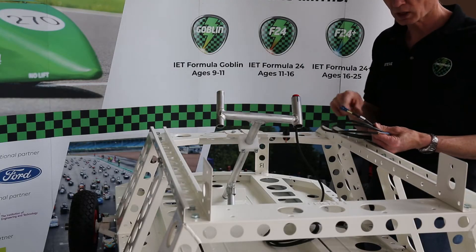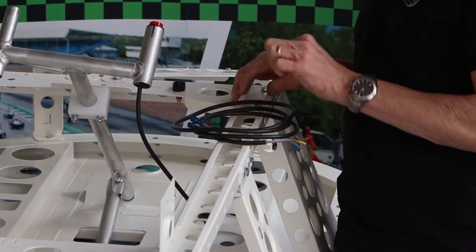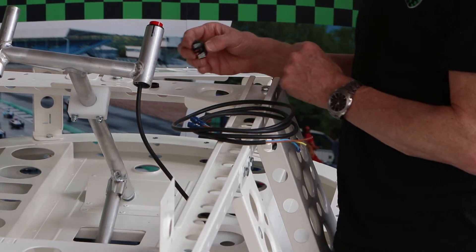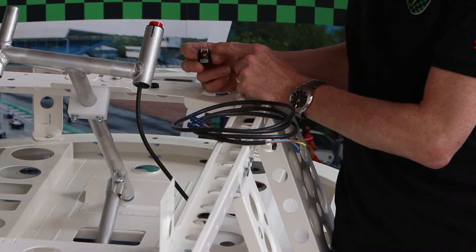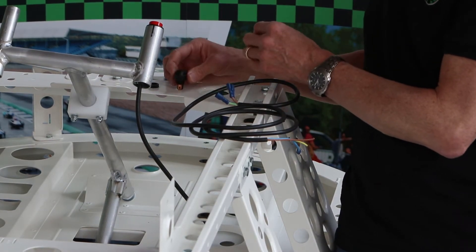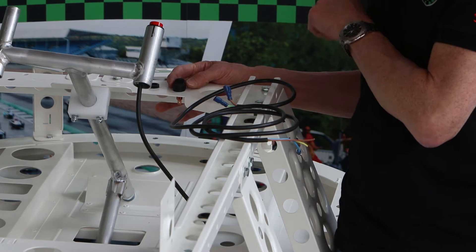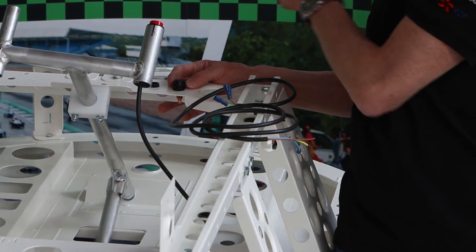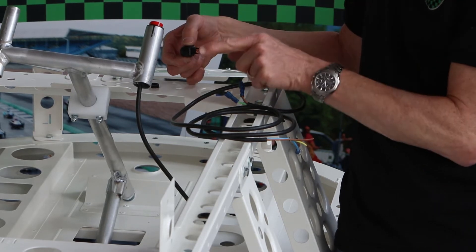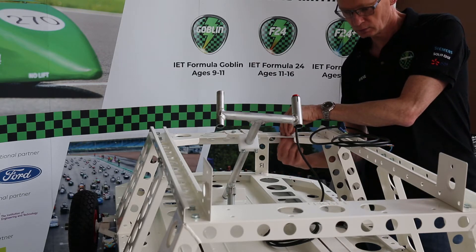My next cable is another multi-core cable, but this time a three-way multi-core, labeled G2L. This is the cable for our front rocker switch, and it's important to get the connections on the correct terminals. On the underside you'll see a little label that says Earth, Load, and Supply, which relates to the three connections. I'm going to place this switch so that if someone wants to hurriedly switch it off from the driving seat they can hit the bit nearest to them — away from them will be on, with the LED towards the front. So in that case, checking my label, I'm going to have Earth to the front, Load in the middle, and Supply at the rear. I need to fit it back on with its little knurled plastic nut underneath before I can attach the spade connectors.